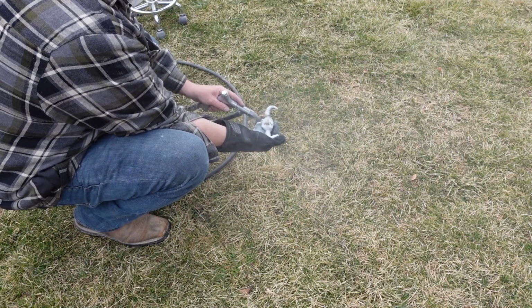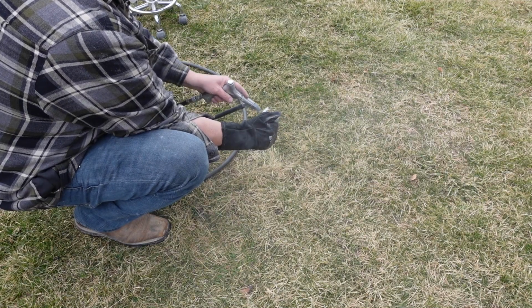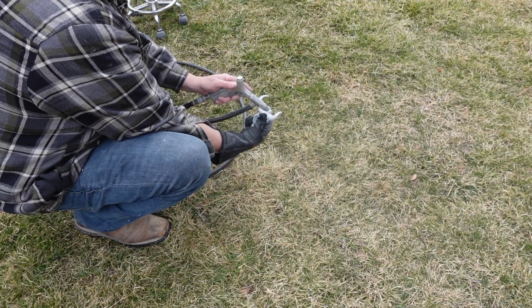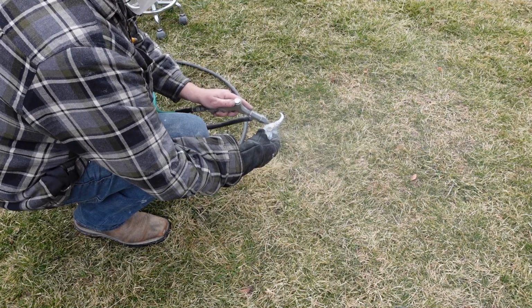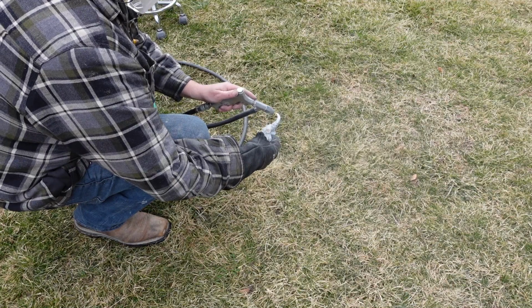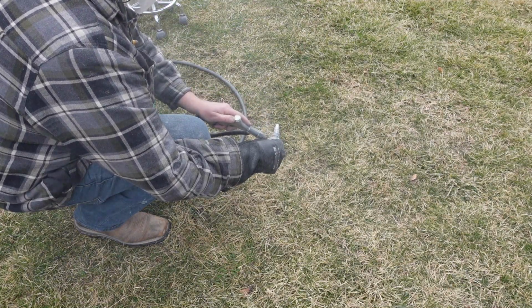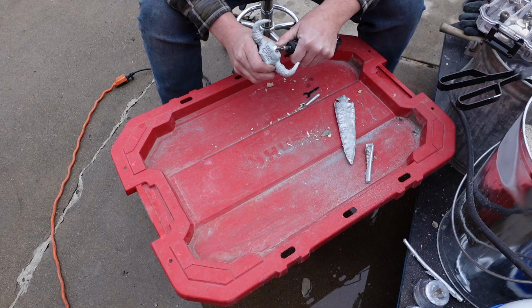But before I did the rest of the metal chasing, you bring it over, sandblast it. I do have a box sandblaster that I got from Harbor Freight. Works amazing, but it is getting everywhere. So I gotta go in and clean it up and fill the seams with caulking so that it doesn't get the dust everywhere when I'm using it. So back to the metal chasing.